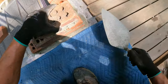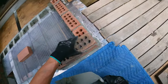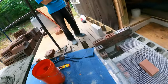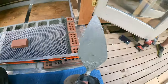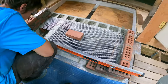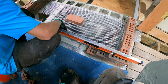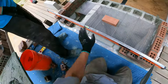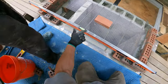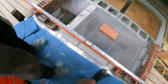Give me that long level there. Just put it right across here and we'll see what it's doing. This side needs to go up — no, down. This side needs to be up. Watch out — my brick's going to be hard by the time you figure it out. This side's high. Leave it — that side's established, you don't touch it. Don't pick it up. So everything comes off one side and goes to the other side. If the bubble's this way then we're high. Don't take much. Now it's beauty.